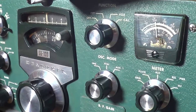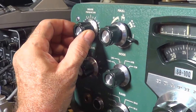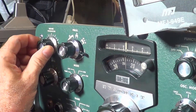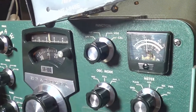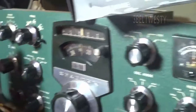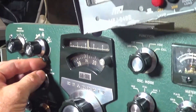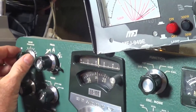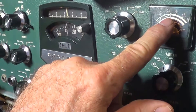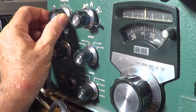Advancing this knob over here - that's about the max it'll go right now, that's about 80 watts. Then you go through and adjust the drive selector here to peak it. It's about 90. You can go over here and look at this at the same time, then adjust the load on this a little bit, peak it, go back again on the drive level. You've got about 250 mils there - that's 100 watts going into the dummy load. You've got to be careful not to burn the dummy load up.